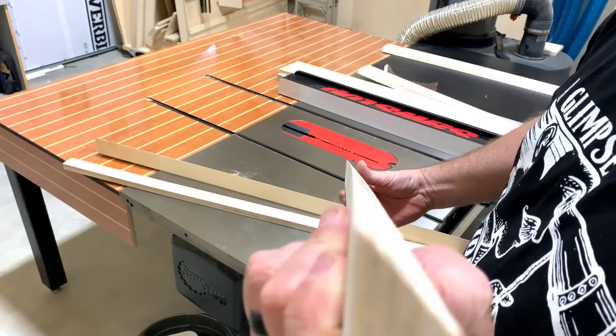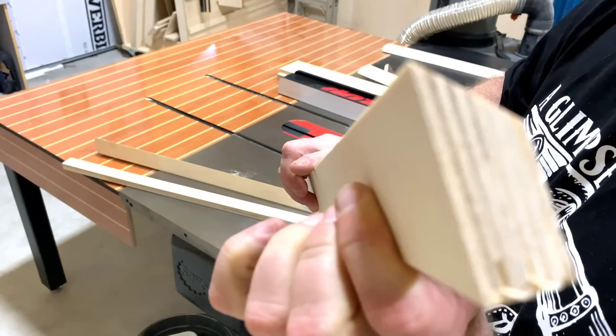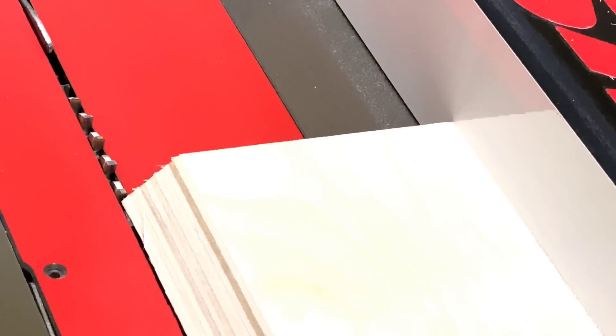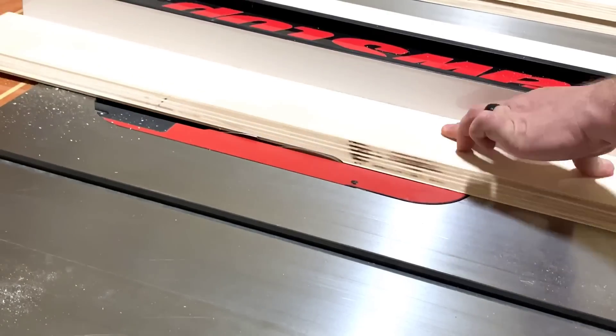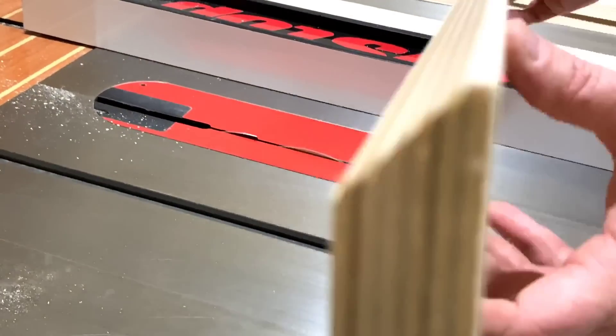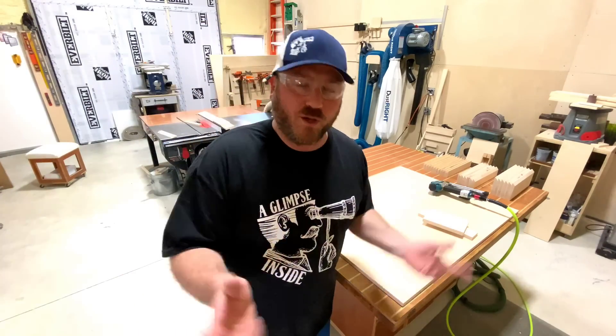You're going to find this piece is very sharp after cutting it to 45 degrees, and you want to get rid of that sharp angle — two reasons. One, you don't want to cut yourself on it, and two, you don't want it to break because this tip is very brittle. I'm just going to barely pass this through my table saw to take off maybe an eighth of an inch. Still going to give me the strength of the cleat, but with no brittle edge. Behind me I have a mock-up French cleat wall.